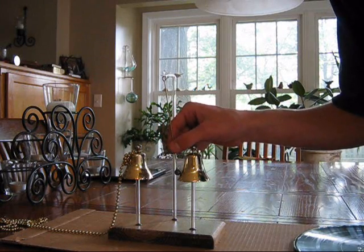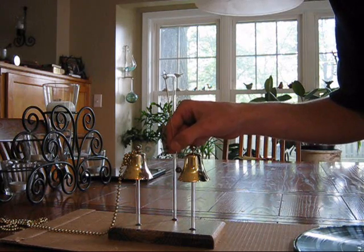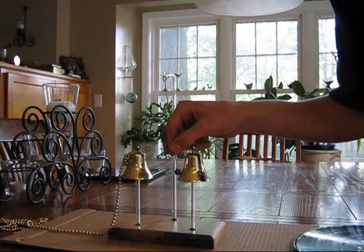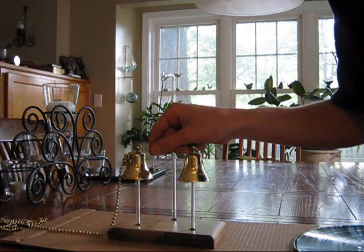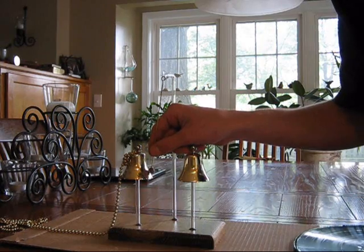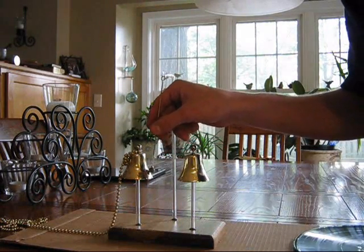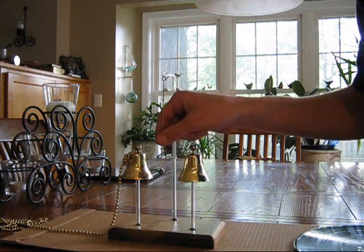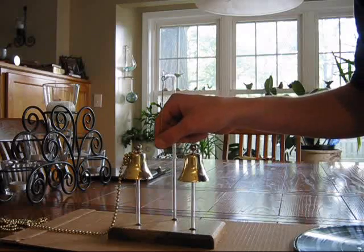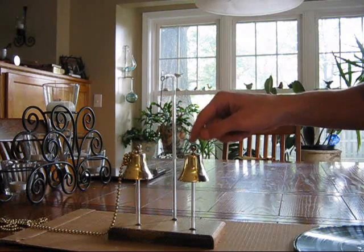When the ball reaches the terminal, it attains a negative charge and now repels this terminal, goes over to this one, where it dumps its charge into the neutral bell, which is connected to the ground. So the charge simply goes away. It's again neutral, or positive, and moves back to this bell, picks up more charge, repels, and dumps it again. So it's just a cycle until the charge has been removed from this terminal.